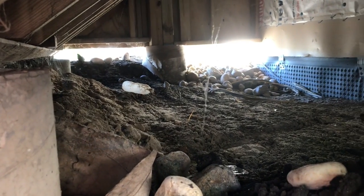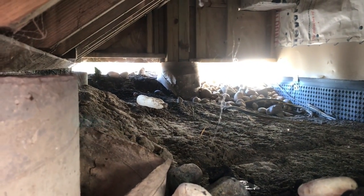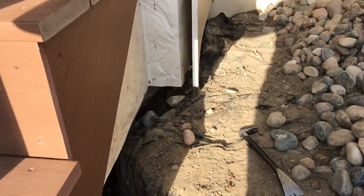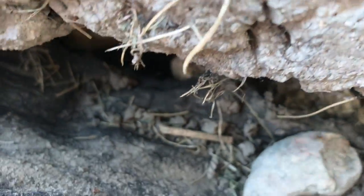I think I have a plan. The footings look solid. Hopefully they drilled those down quite a ways, because the way this is sinking out front, I hope they had them down at least 8 to 10 feet into virgin soil. But anyways, that's really got to be brought up, because otherwise that water is just going to keep going down there. And I've got problems here along the concrete underneath.